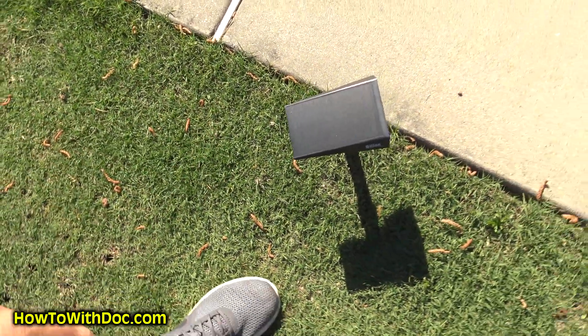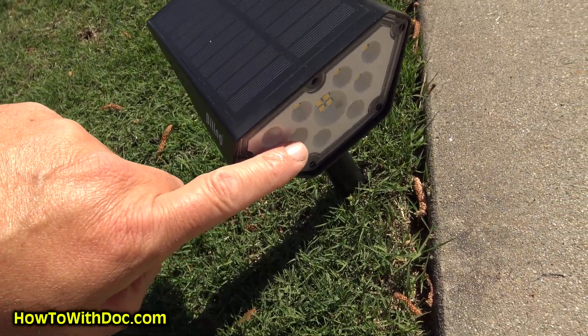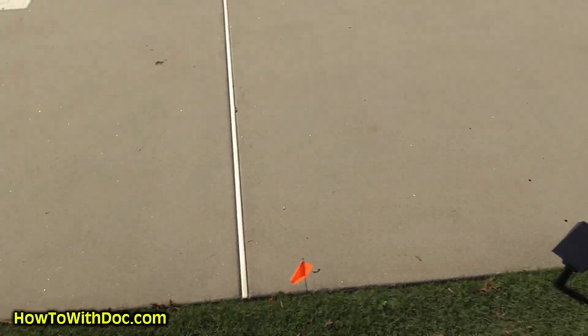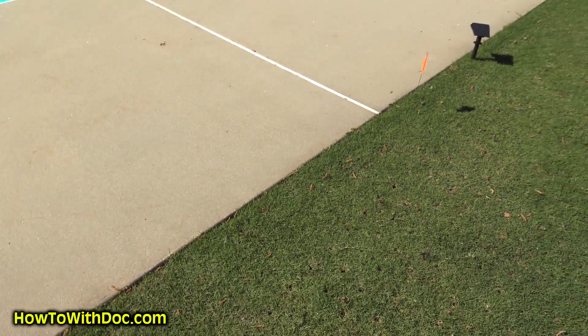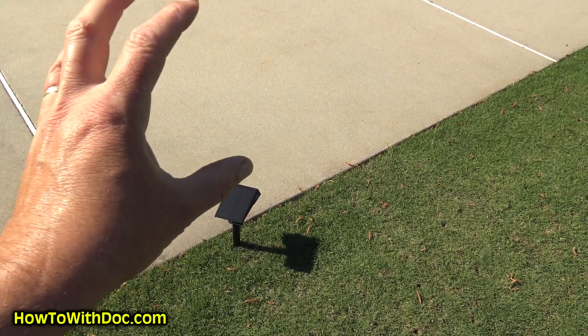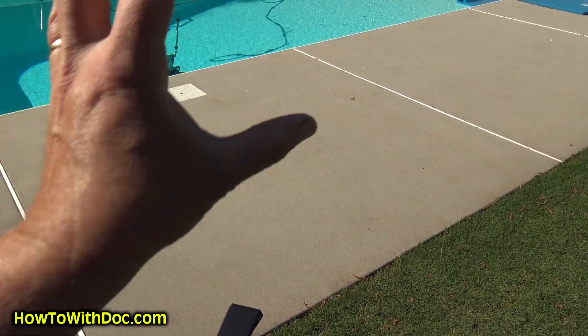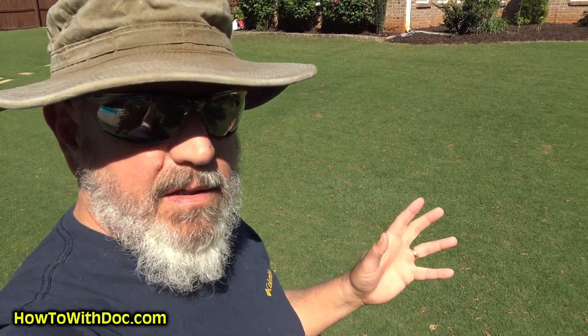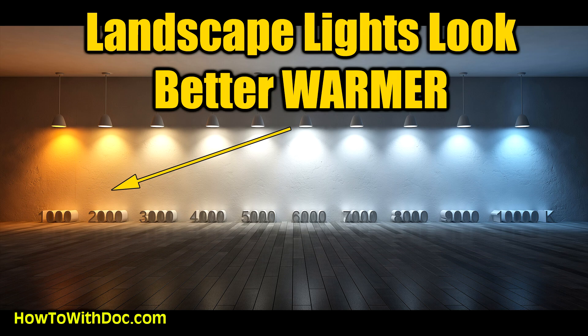So I've got these lights — you can see them. They're all-in-one inclusive: they have a solar panel on the top and multiple LED lights. I've got three of them, and I'm just going to have them cast a gentle light this way. I've learned these give more of a flood — they're not a long-distance spotlight. Big problem with a lot of these lights is the Kelvin scale. It goes from bright white or almost blue to more yellow, and landscape lights really need to be on the warmer, more yellow side.